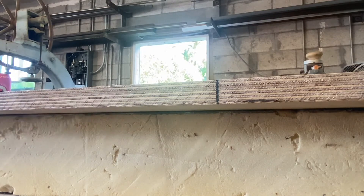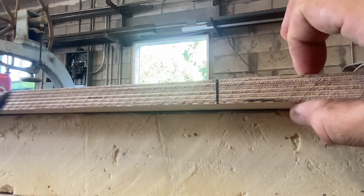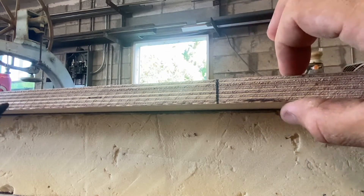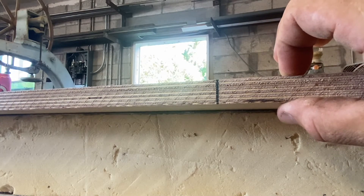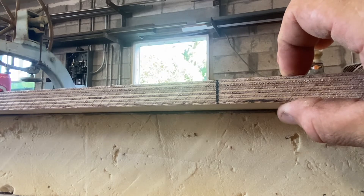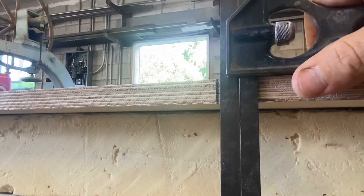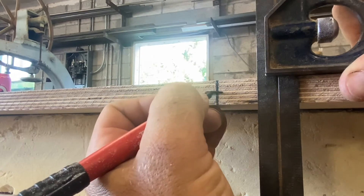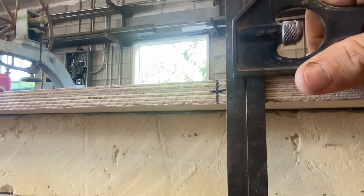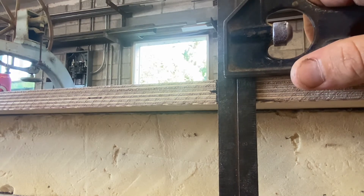Here's a little geometry trick to find the center of anything that's a fraction — say, three quarters of an inch like this piece of plywood. All we're going to do is multiply the denominator by two. So instead of saying three quarters of an inch, or three over four, we're going to say three over eight, or three eighths of an inch. Then all you're going to do is measure down from one side three eighths of an inch — that's the center of the thickness of the piece of wood.